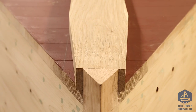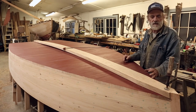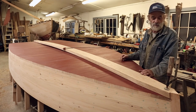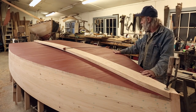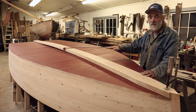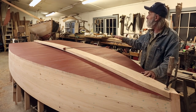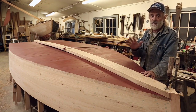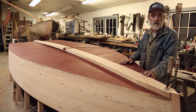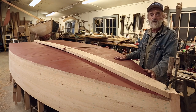There it is — our first runner up in position. I'm not going to take this opportunity to paint the back side of it and nail it into position just yet; I'm going to leave it clamped down there, it's kind of trained into itself right now, and move on to the next two runners. I can't tell you how important all of these runners are. This first one you could refer to as the keel of the boat — I just call it a runner. The next two would be obviously side runners, and then on top of those there's going to be deep runners. Without these runners, with a very flat bottom, the boat would just be skidding all over the place with handling problems and it'd be dangerous. Once I get the next two on there that's going to hold this boat directionally in the water really nicely. At that point I'm going to get these next two cut out, put in position, remove them all at the same time, drill the rest of the holes, paint the back side of every one of them, put them back in position again, nail them into position, fasten the ends down, and we'll be done with that operation.